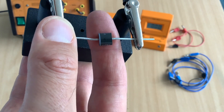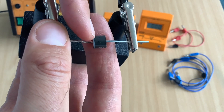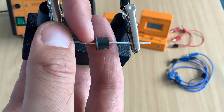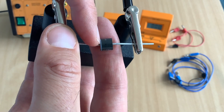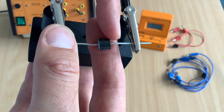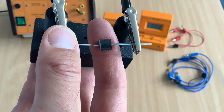Let's start by looking at the diode. The diode has got this silver on this side, but it doesn't have the silver on this side. This shows us that if we want the current to flow, the silver side has to be connected to the negative side of the power supply, and the side without the silver to the positive terminal of the power supply. So that's how we're going to connect it to begin with.